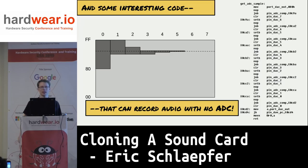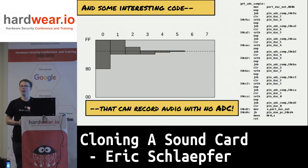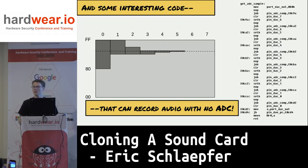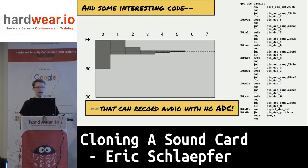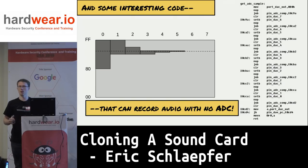Another interesting bit of code has to do with how the Sound Blaster digitizes audio. There is no analog-to-digital converter chip on this board because at the time they were very expensive. What Creative Labs did was use an 8-bit DAC connected to a comparator — giving you a comparator with an adjustable threshold. Using a process of successive approximation, you keep dividing the difference until you have the exact value of the sample. Nowadays they still use it but it's typically within the chip — if you see a SAR ADC, that's how it works.